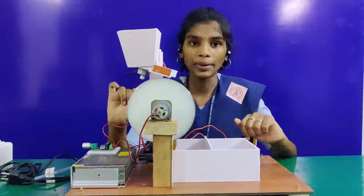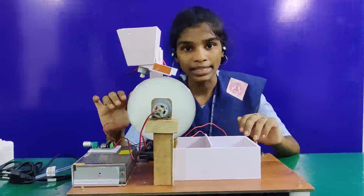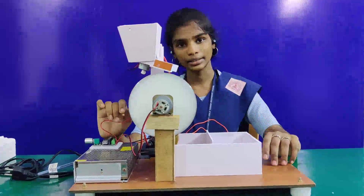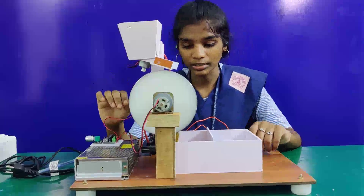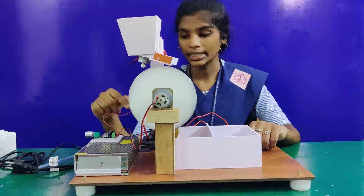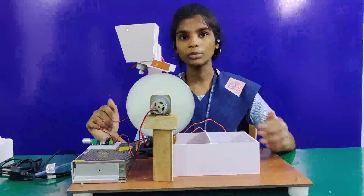The inner side of the hopper is coated with aluminium foil which charges the particles by electrostatic voltage. The static segregator is a drum-like structure coated with aluminium sheet on the outside and pre-lined with a nylon insert, connected with a DC motor which rotates to enhance the separation process.